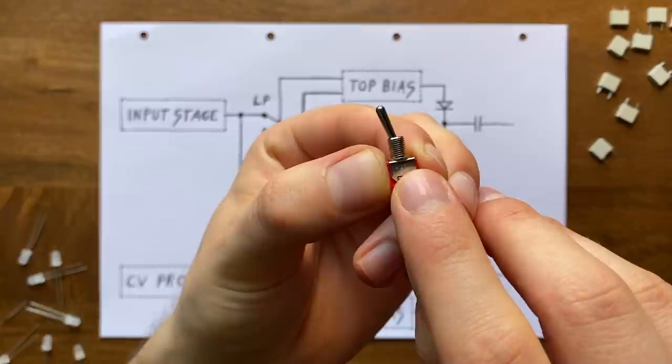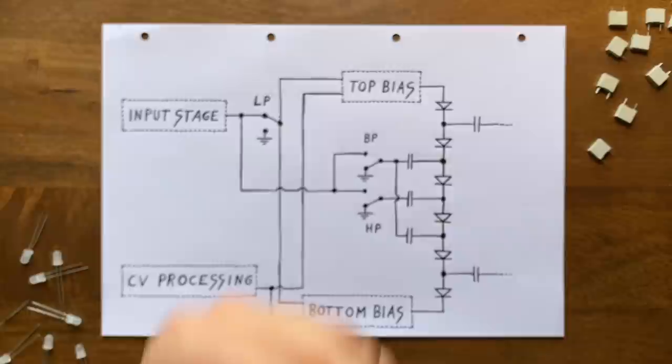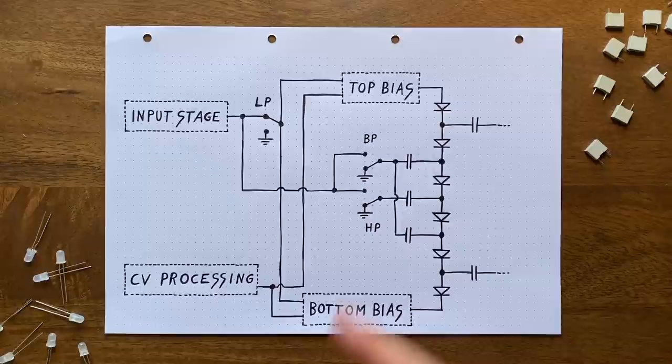In this one, the common connector is wired to the A terminal. And in this one, it's wired to the B terminal. Note how it's a bit counterintuitive, because the active connector is always the one the toggle is pointing away from. Effectively, this lets us hook the common connector up to one of two sources. In our case, those two sources should be the buffered and scaled down input signal or ground. If we then wire the common connector up to our ladder's middle capacitor, we can send in our signal to be high-pass filtered with the flick of a switch.